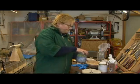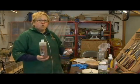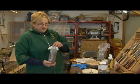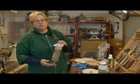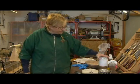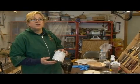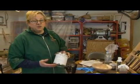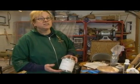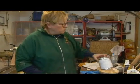finish. Other finishes that you can use are oil finishes. This happens to be a walnut oil finish, and it's very, very good for utilitarian and food safe bowls. And this finish is a urethane oil finish. It tends to be a bit more durable and long lasting, and it also penetrates a little deeper into the wood.